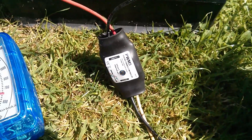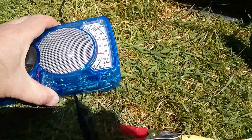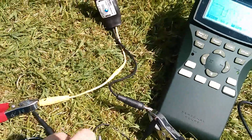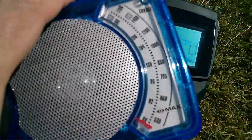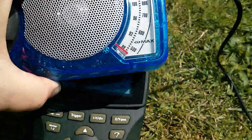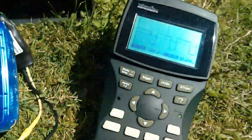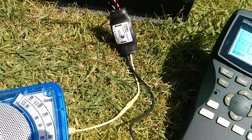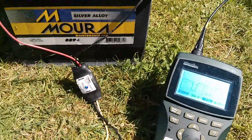What's odd — I worked hard on the RF emissions so there isn't so much, but I was getting some weird effects. There's the 122 Hz tone. I was getting almost like a third tone, but then I discovered that the oscilloscope is putting out a high-pitched whine, something to do with the display it would seem. The PWM5 doesn't really put out much RFI, but I was getting a mixture of scope RFI and charge controller RFI.